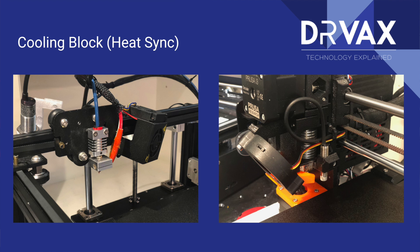We need to think about how temperature is controlled across those transitions. You have the heater block, the heat break, and the cooling block. The cooling block on the Micro Swiss hotend is a round cylinder and is much smaller than the larger cooling block on the Prusa i3 MK3, which has more surface area to radiate heat. So you need to make sure that if you're using a Micro Swiss hotend, your fans are operating properly.